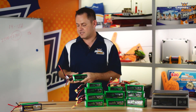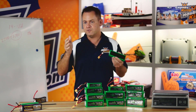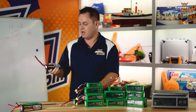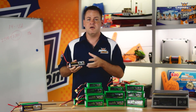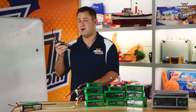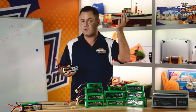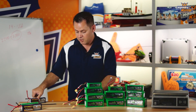Here's the tricky part: when you increase capacity, even though the C rating is lower, your amperage goes back up. For example, if this battery was 10C, it could only deliver 37 amps. But if we made the same battery 5200mAh at 10C, that's 52 amps. So even though the C rating is lower, because capacity has increased, the effective amperage is therefore increased as well.